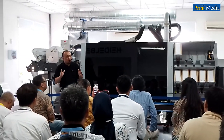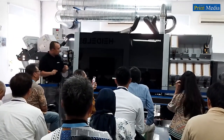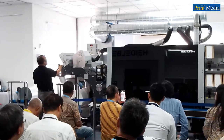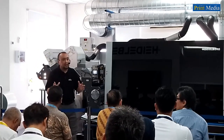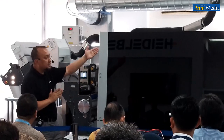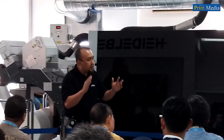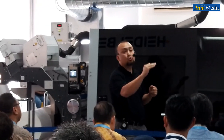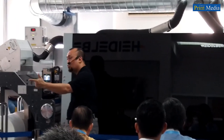Gallus One prints CMYK plus white on roll material. On the left, at the unwinding station, it has the features and functionality to prepare any kind of substrate perfectly for the DPU, the digital print unit. Our web vision system helps the operator in automation of the printing process. This enables optimum print quality, which can be achieved by faster setup time and less waste.